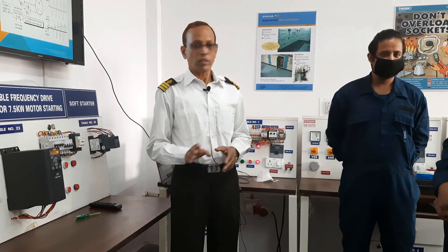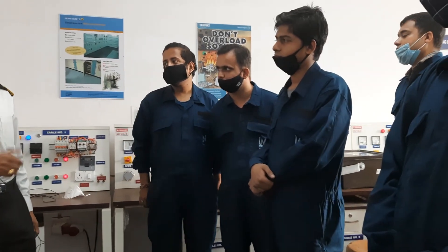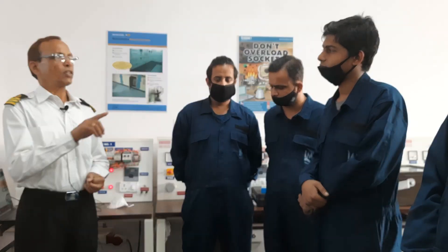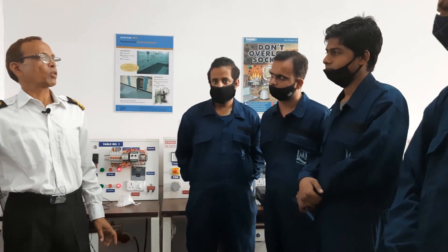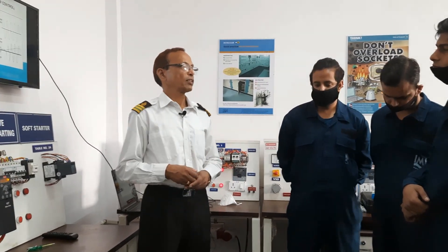Can the data be saved here? It is already saved inside. Let's say you have set the data for this motor — can you separately save the configuration of another motor? Some drives give that option, some don't. Otherwise you have to change it because — I worked in a paper mill — there was a 35 kilowatt motor which burnt, the VFD was burnt. We tried on another motor, it was not working. The manufacturer came and changed the full program, and only then we could run another motor. So this VFD is dedicated to one motor; you set the data of that particular motor you are going to run. If you don't set that data, it may malfunction because the brain inside only knows what you have set.